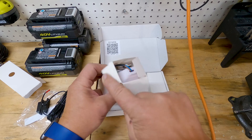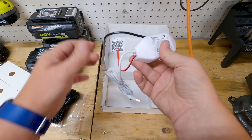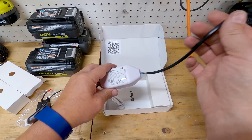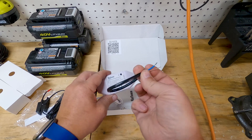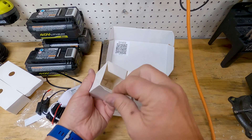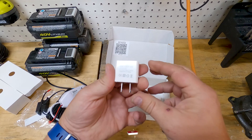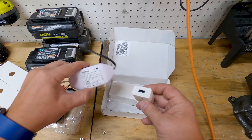This is the actual main unit. It's got a USB plug that powers it up, a port where the magnetic switch plugs into, and a little pigtail that will hook up to those two terminal strips that I jumped out before. And in the other box, the power brick — a USB power adapter, five volt, 1000 milliamp or one amp — which is enough to power this device.